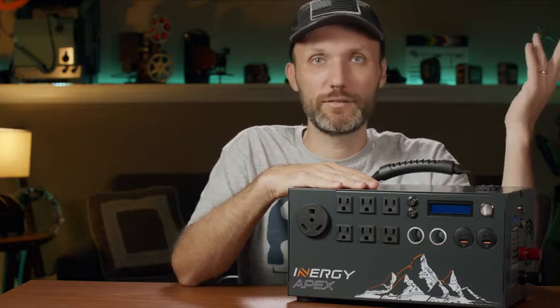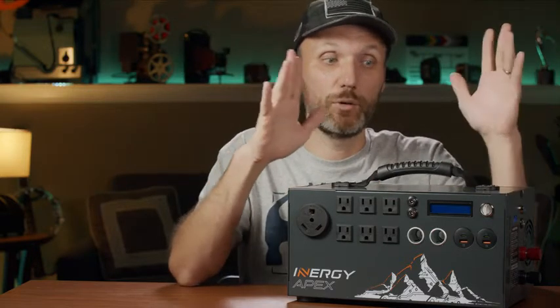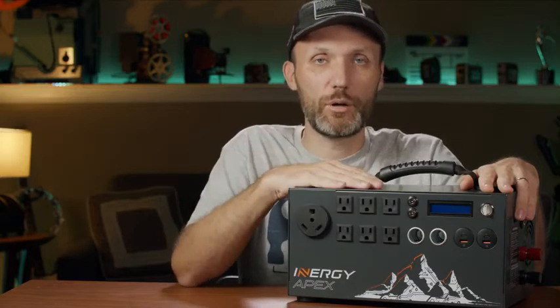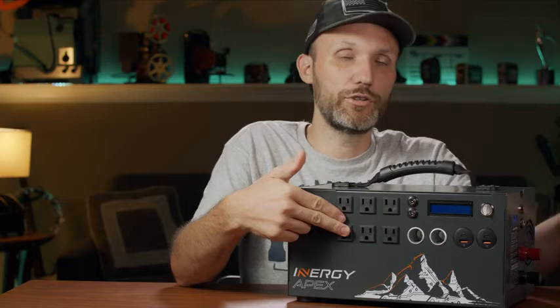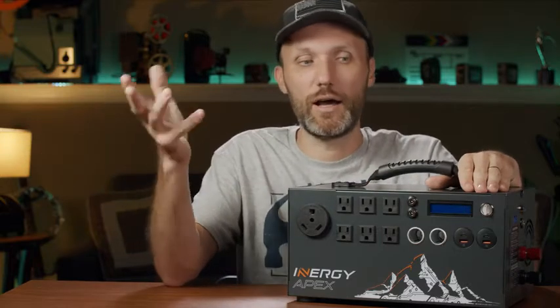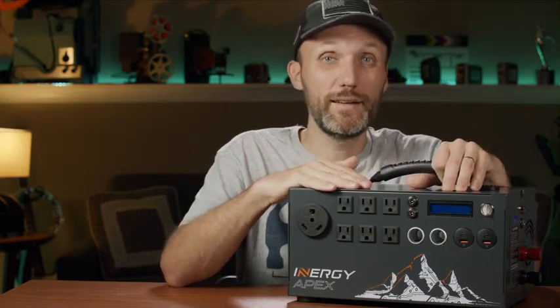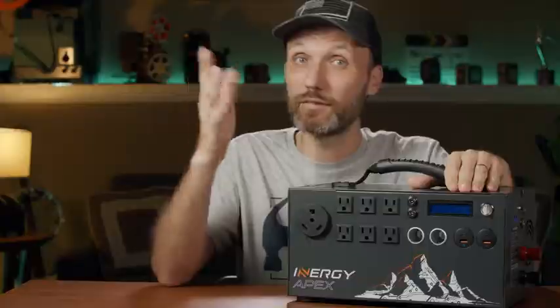If you've never used anything like this, I'd say just buy the Energy Apex panels — they're plug-and-play, you chain up to five panels together, and you can charge this in around three hours. You can also use this while charging simultaneously via solar panels. If you're drawing less power than the panels are putting in, the battery level will still rise. If you're drawing more, the battery drains but at a slower rate than without panels. Either way, it works best with solar panels — I'd say minimum two, but three, four, or five is even better.